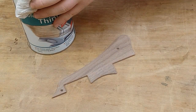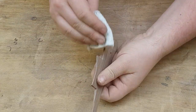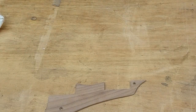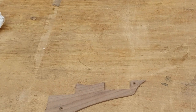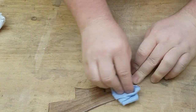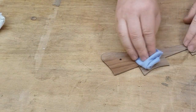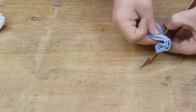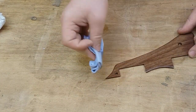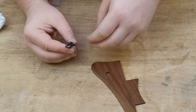Just using an acetone-based thinner again just to clean off the wood and get all the dust off. And once again we're using True Oil as our finish of choice here — same reason as everything else, I like the finish it produces and it's easy, pretty much foolproof to apply. What I'm just realizing we missed is the fine shaping — I used files just to shape the pickup sections on the pickguard. It was just a case of placing the pickup rings from my previous video on the guitar and then shaping as needed until the pickguard fit on nicely.